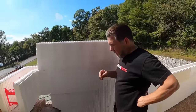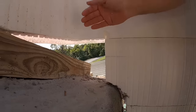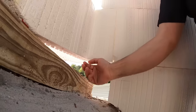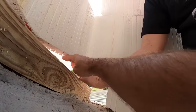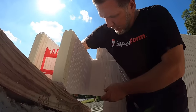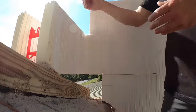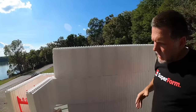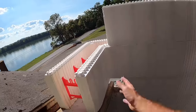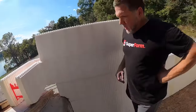Let's talk about that. Well, the potential problem with that is when we pour concrete in, we would have a piece of wood coming right down here. So the concrete would come out to this edge. You'd have a 2-inch gap, a 2-inch flat part under the ICF. That would create a shoulder so that the concrete would come down here, and that would want to lift on this as you were pouring. Which could be handled, but it could potentially be a problem area. I could just run strapping down and tie it in. You could tie this clear down in with this.